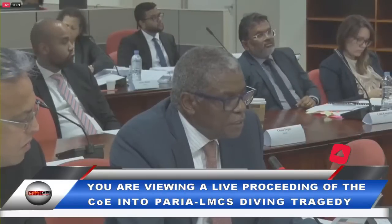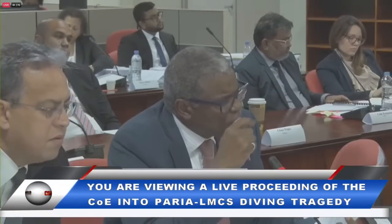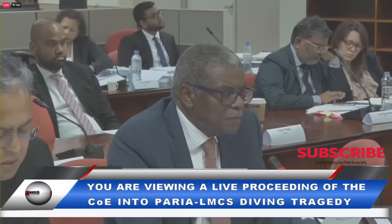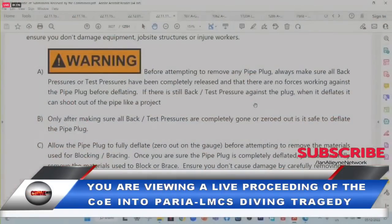Finally, page 9837 of the bundle of submissions. That's so many bundles. That's the manufacturer's specifications. The warning at the last page. Mr. Alleyne, it says this: Before attempting to remove any pipe plug, always make sure all back pressures or test pressures have been completely released and that there are no forces working against the pipe plug before deflating. If there is still back/test pressure against the plug, when it deflates, it can shoot out of the pipe like a projectile.